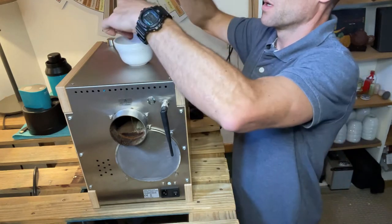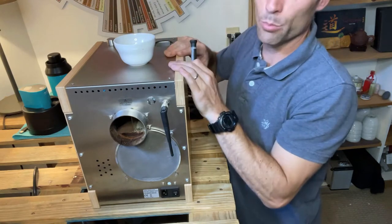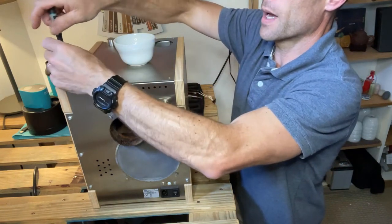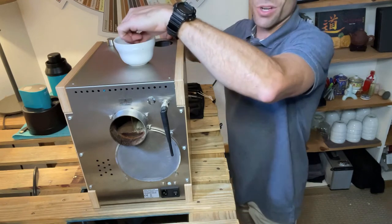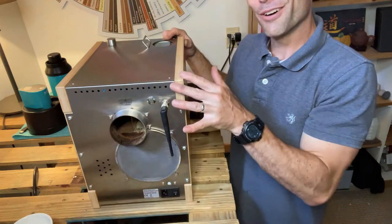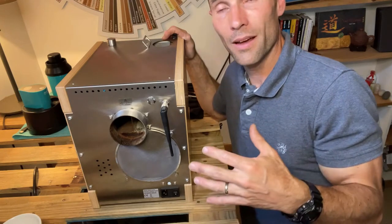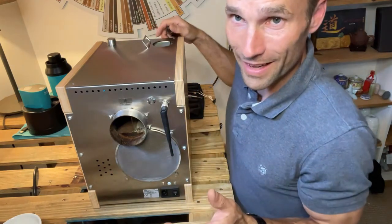There's an importance to creating balance when you are tightening or loosening. This is true on your car, it's true on metal plates. When you're creating alignment, you don't want to create a lot of tension on three corners, because that'll possibly pull the fourth corner and you won't get the screw to go in. So I progressively tighten opposite corners. If you're not taking video of your machine coming apart, take pictures step by step. Whenever you pull apart a machine, if you take pictures of the process and label things, it's a great reference — kind of a how-to kit if you ever sell your machine or forget how to put it back together.